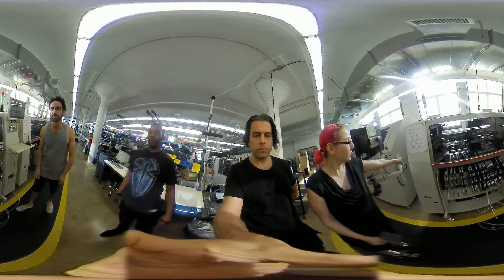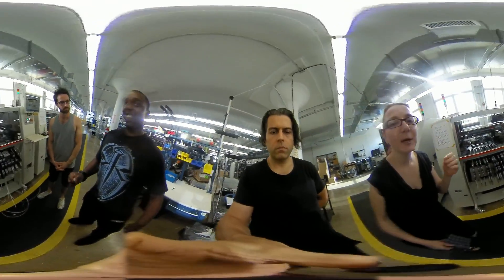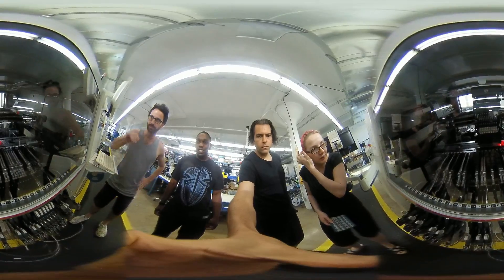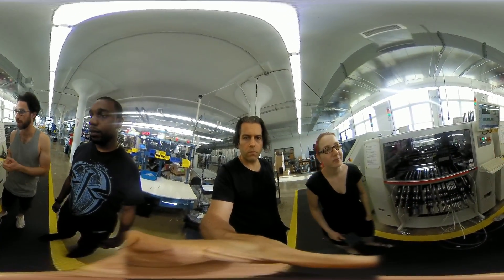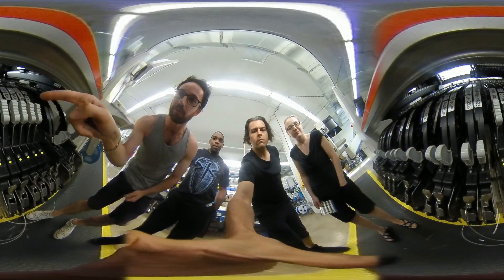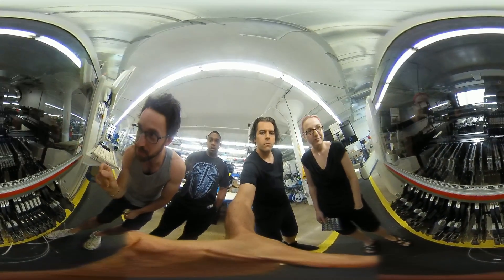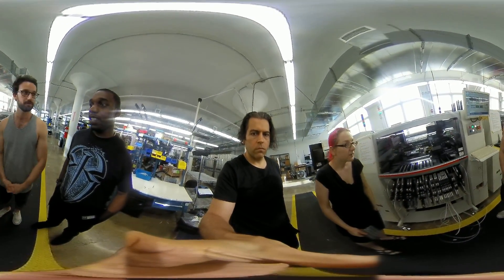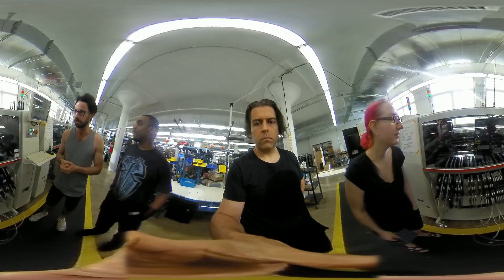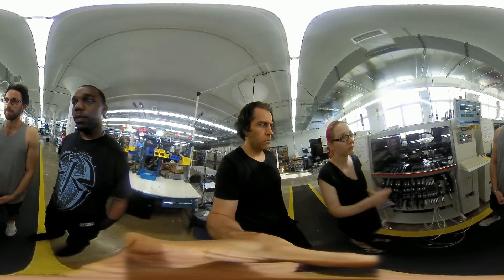This is the SM-41. After that, the board is in the middle and it's got the solder paste on it — it's sticky and pasty, like peanut butter, without the jelly. This machine is one of two pick-and-place machines in our line. It takes each tiny part from reels called feeders using pneumatic suction and places them very precisely onto each PCB on the panel. It's referred to as the chip shooter — it has ten nozzles, so it picks up and places ten parts at a time, making it ten times faster than our old pick-and-place.